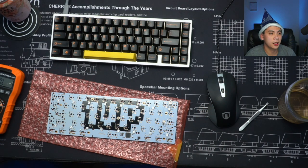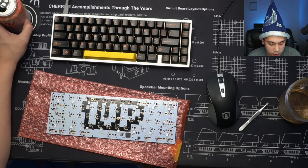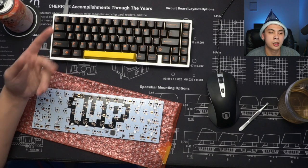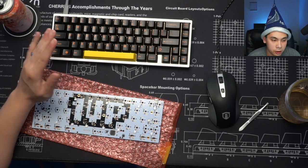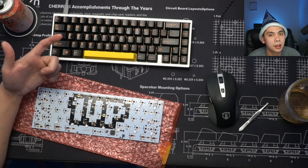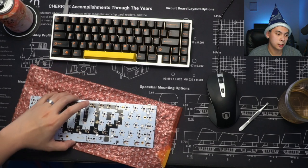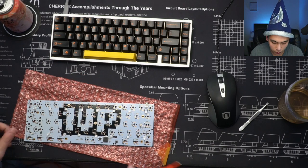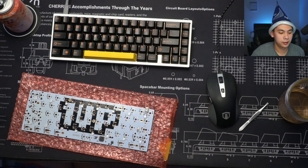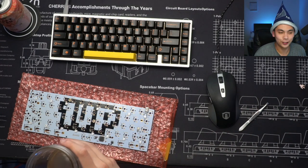Mr. Pulito says, can I do QMK on any keeb? You can do it with most enthusiast keebs and some OEM boards. Basically, the main requirement is that the microcontroller needs to be supported. So if you go on the QMK documentation, there's a list of supported microcontrollers, such as the ATmega32U4, ATmega32A, ATmega328P, and a couple other ARM microcontrollers. But typically, if it has that, your chances of getting QMK on it are upped significantly. But don't expect to put QMK on a Razer. Though if you can figure out how, you're going to be a hero. Everyone's gonna love you. Sark says, couple of ARM. Well, I just know it's STM32 something or another.